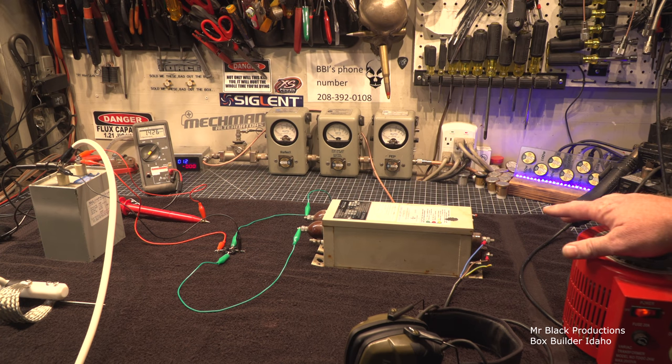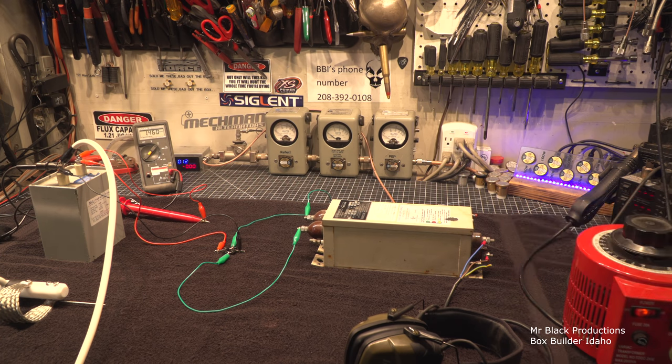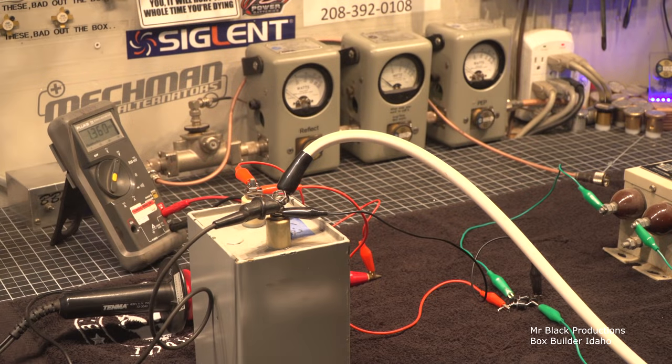We got the green blinky light over here. So there's 1,000 volts. Nope, transformer's tripping out. Must have a diode that's gone bad. There we go. No. We have a high voltage breakdown someplace. Let's go identify it. Well, I'm kidding. This is actually the perfect scenario for this test.